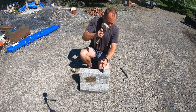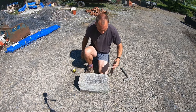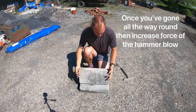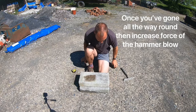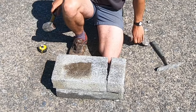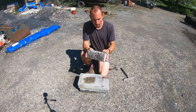This block is quite old so it'll be a bit harder to cut than some blocks which are quite fresh. You can increase how hard you tap it now, and then give it a good whack and you should get a nice clean break. And that's the hammer and bolster.